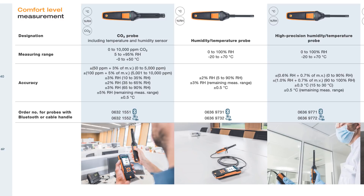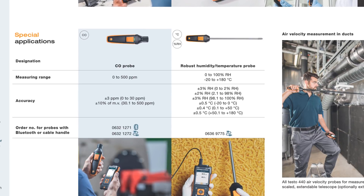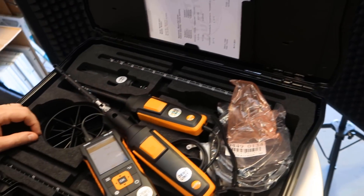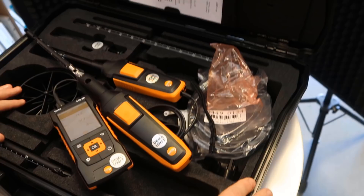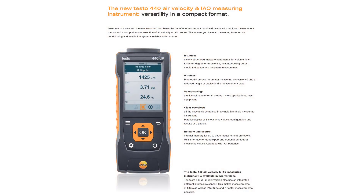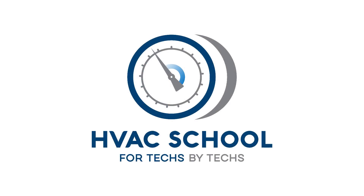If you add this with something like the Testo 420 flow hood, you can take almost any test you would need. They also have optional meters I like — a carbon monoxide meter, a lux meter for measuring light quality in an area, and one that measures turbulence in a room using a large dome you set in the room. You really have a wide range of options with these two device handles connecting back to the 440 DP. This is the Testo 440 IAQ — a great option for anyone doing high-level testing of airflow and psychrometrics, available soon at TrueTechTools.com. I'm Brian Orr with the HVAC School podcast and HVACrSchool.com.